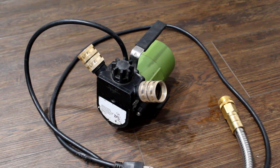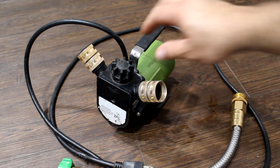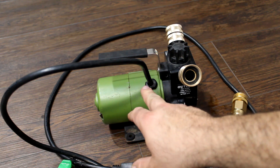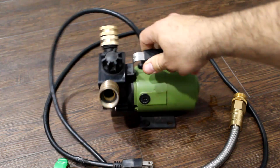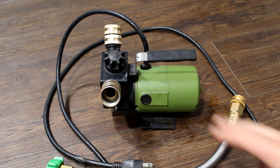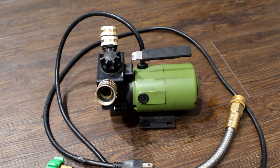This pump lives in our greenhouse and is exposed to sunlight, heat, dust, and humidity — and it's held up fine and works every time. Over the year of owning it, the motor power and flow dropped off, and I noticed arcing inside the motor when running it at night. I could see the bright sparks through the little fitting and their reflection on the mounting plate. As the carbon brushes wear out, the spring has a harder time keeping the brushes against the armature. So I unscrewed the caps on each side, reset the carbon brushes by pushing them further in, and immediately noticed power and flow return.